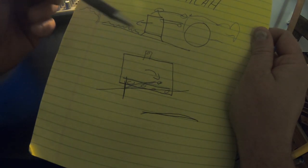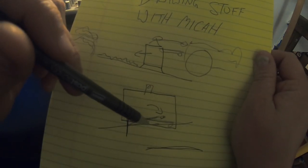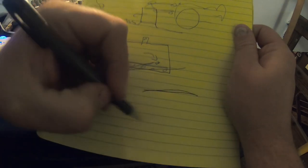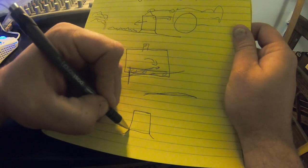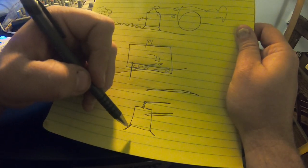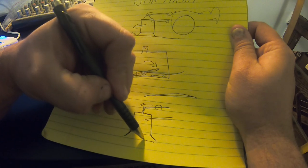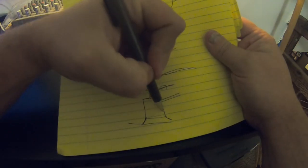So what's interesting about using the box blade like this is this back edge is doing a ton of work. It's busting the material, and then when you're driving forward, it's also doing a lot of the work smoothing the material. And the way you make that really work well is when you're finishing your driveway, if you look inside your box blade, there's a blade in the back and a blade in the front, right? There's your top link, there's your side link. If you're really getting fancy, you loosen this top link up to push your box blade that way so that you're impacting the ground like this. So there's flat ground, your front blade isn't touching, only your back plate is, and you're driving this direction.